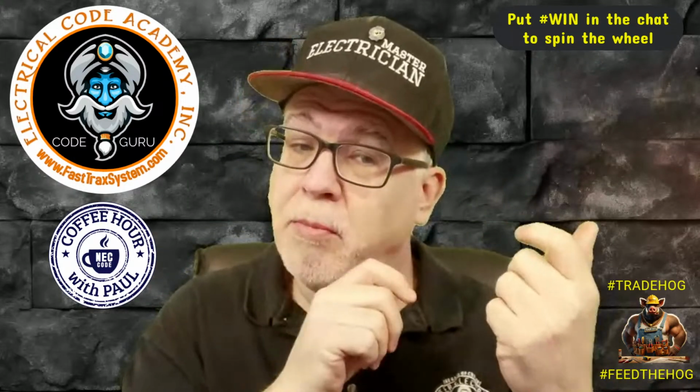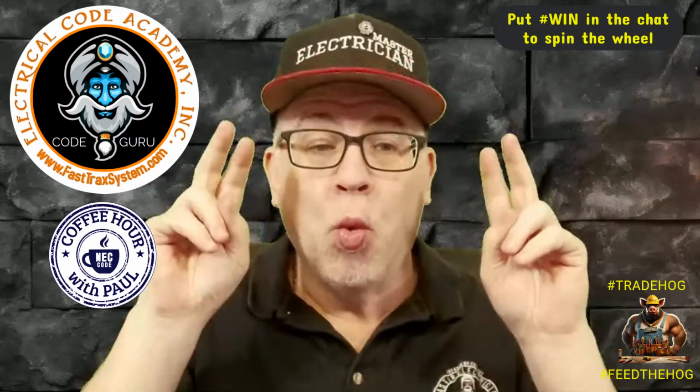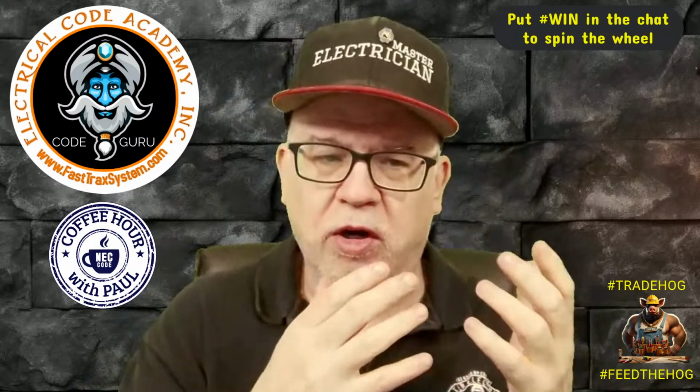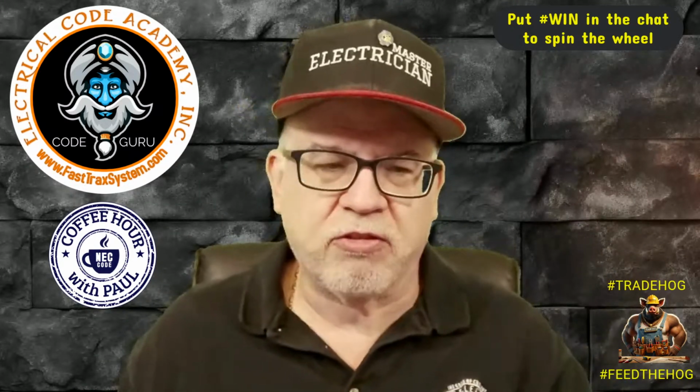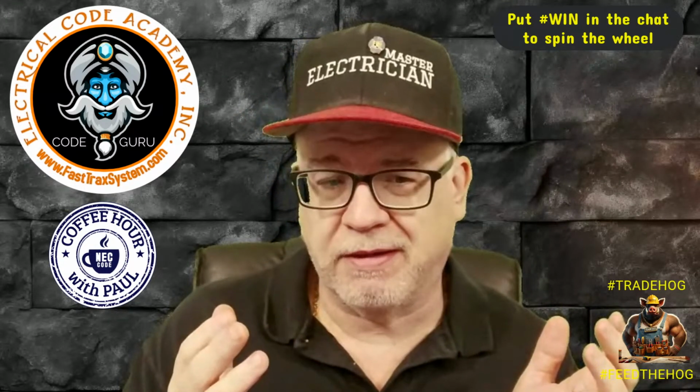Even though there might be multiple conductors for phase A, they're acting as one conductor. And you're going to get more current out of that because you have more conductor size, more circular mils. Does that make sense? So that's kind of the quick and dirty when it comes to paralleling.